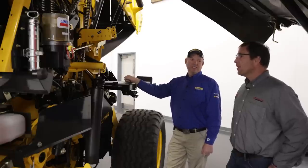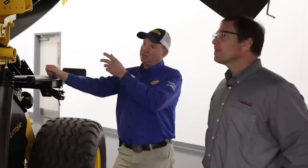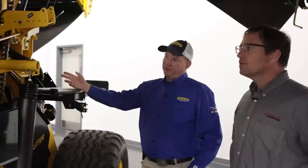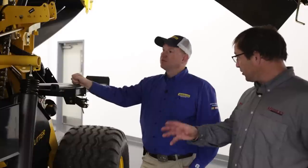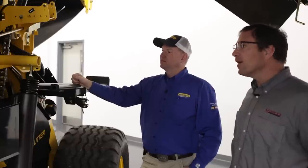That's a Diamond brand chain — all the chains on this baler are Diamond brand chain. There is an oiling system on the front of the baler. It comes standard with the baler and it works with every tailgate cycle, injecting oil onto the chain. So every time the tailgate opens, it's going to inject some oil on the chains for longevity.